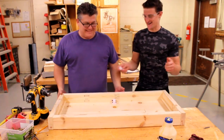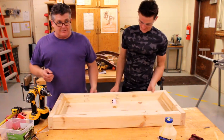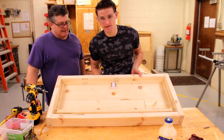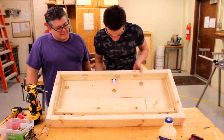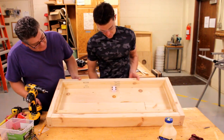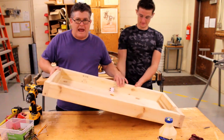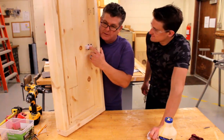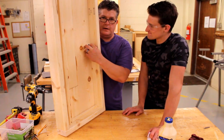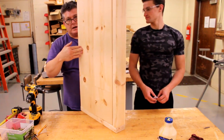We accidentally found something out — we just covered it by accident, we've got another secret step. The magnet will release it, but you've got to release the pressure on it. The way this works is the magnet goes on the other side. Typically if it was loose, the little latch up here would fold in. But the way to unlock it is you have to push up on this board, which is something we just invented. Once you push up, bam, it snaps open. These magnets are made for child-proof locks on cabinets, and they're not made to have weight on them — but ours will. Now what we have to do is push up on it and it will unlock.